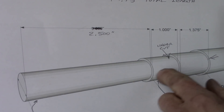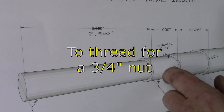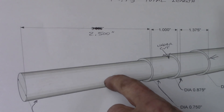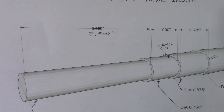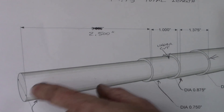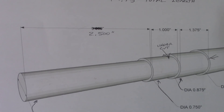Here's what I've got to do — excuse my sloppy drawing. This section here is reduced from the 3/4 shaft to fit right there. Then this area is reduced for my 3/4 inch nut. And then this section is reduced to 5/8 inch, which I'll use to hold it in my chuck, and I'll run a steady rest out here. That's how I'm going to cut it when I can't stick it through the bore.